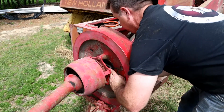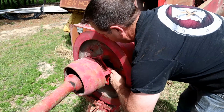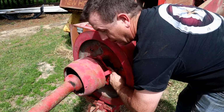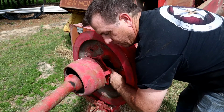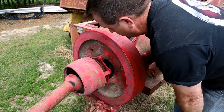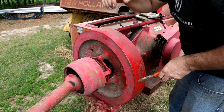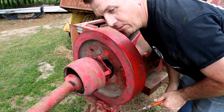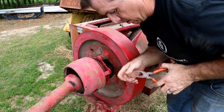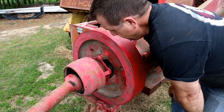But you're probably going to be asking yourself, like, why did this happen to me? What did I do to deserve this? Well, it is actually your fault, and there's a couple of reasons why it happened to you. One, you had your tension set too tight on those levers that pack the hay. That sets your bale density. Those were set too tight, and you ended up breaking your line.